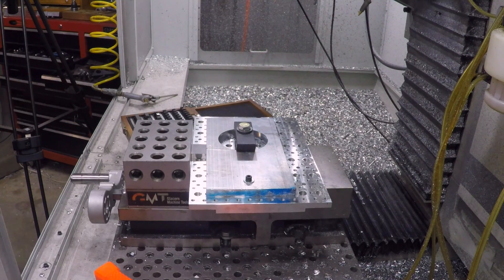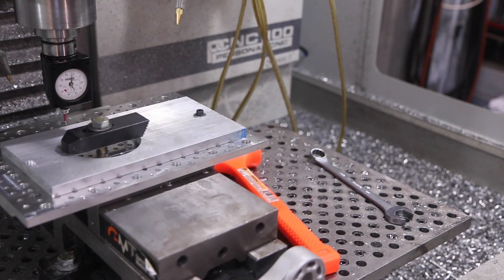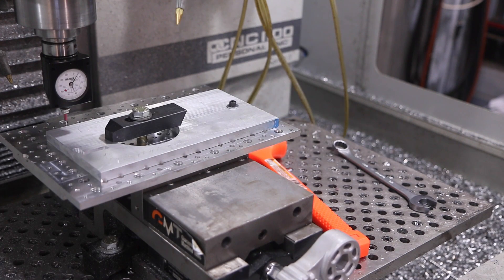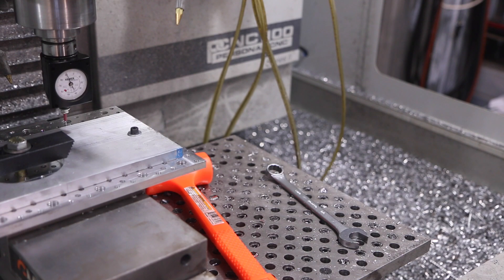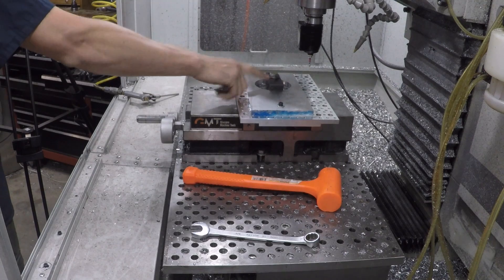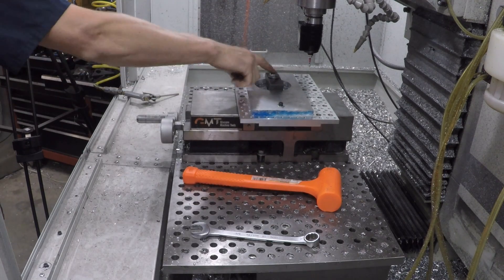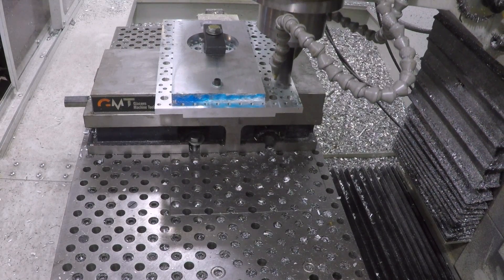Let's check it with the Haimer — who caught that the part was flipped upside down? The Haimer's on the back edge. That's plenty good. This is going to be plenty good, but let's show you what the runout is. I'll zero that in the Y and we'll go over — maybe four thousandths across six inches or something. Plenty good. The really important thing, folks, is you've got this huge clamp sticking up, so you need to check your cam tool path and make sure you're not going to crash into it. We used our point over here with the Haimer to find XYZ zero.